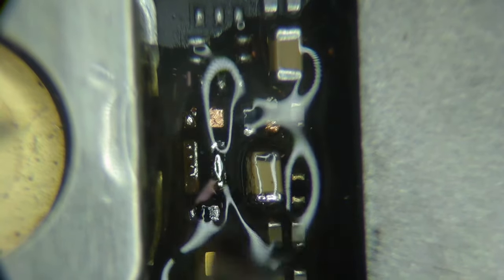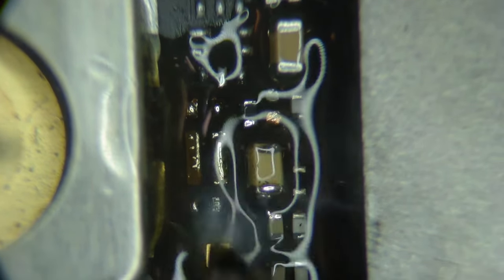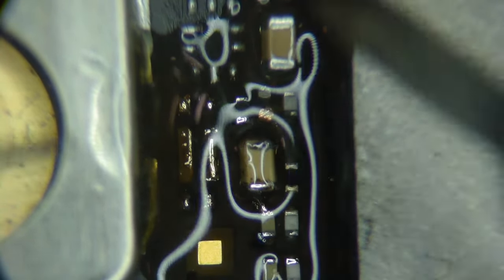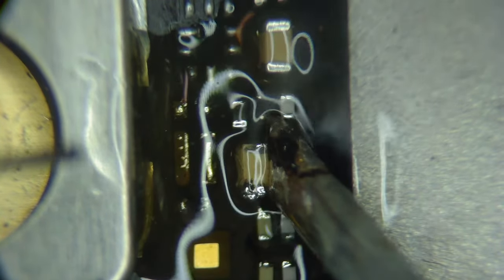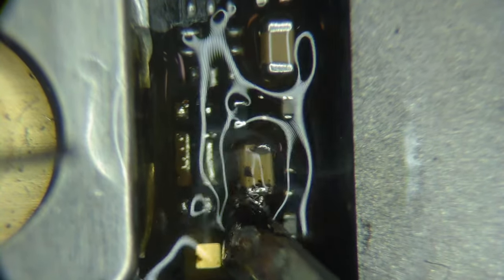That resistor cleaned up nicely. Yeah, that pad'll be fine with all of it connected like that. Some clean solder on that. I'd rather not use hot air in this corner if I can avoid it. So I'm gonna try to get this out of here with just this. I'd have to, let me get the other handle.